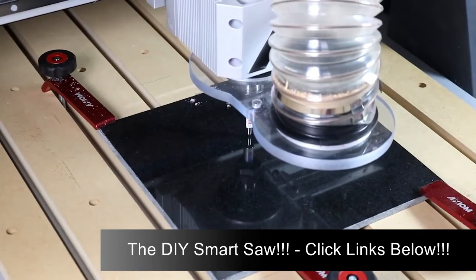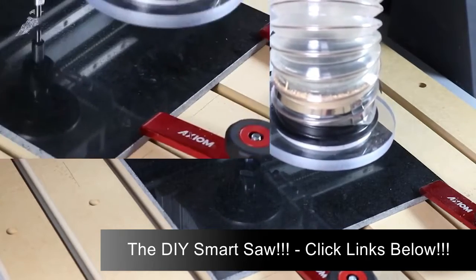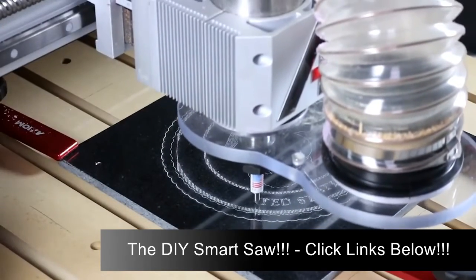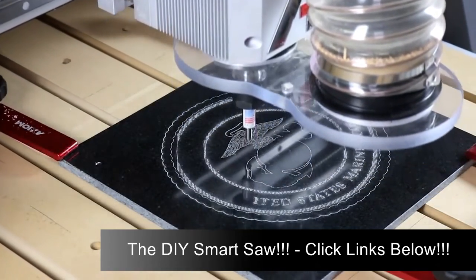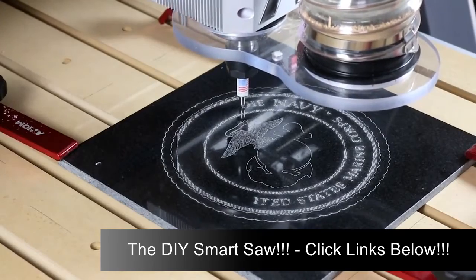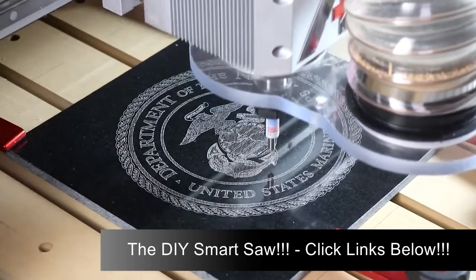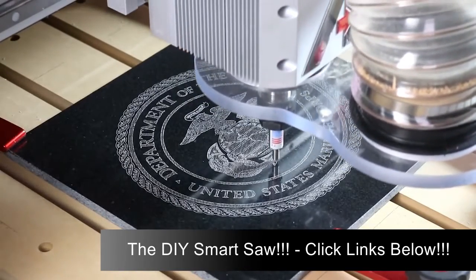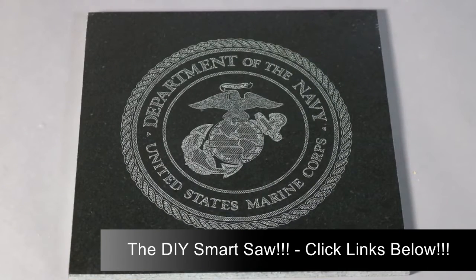Here's another case where you'll set the spindle or router RPM to zero — you don't spin it for this. This is a diamond drag; there is literally a piece of diamond in the tip of this tool. When you set depth of cut on the diamond drag, what you're doing is controlling how hard the spindle pushes down on the compression spring and the tip. Harder materials require more down pressure, and it's all well explained in the instructions that come with the tool. This work can be done on granite, glass, aluminum, brass, steel — lots of different materials. I love the look.